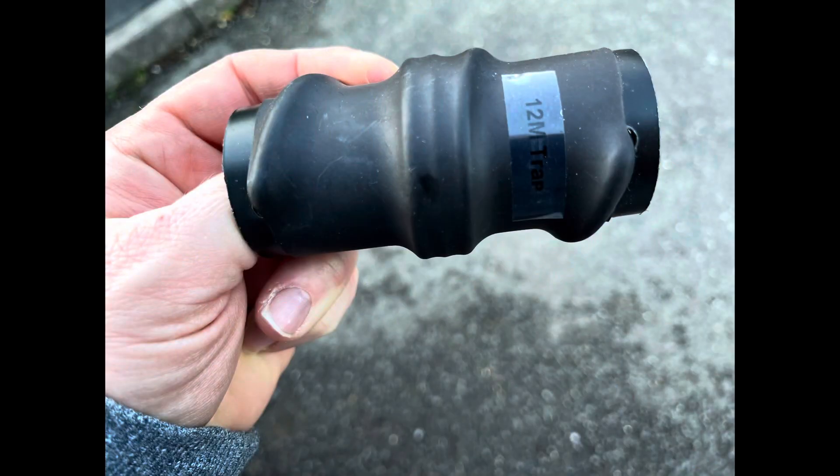And yes, we're going to use a coax trap. Now don't be afraid about using coax traps. Providing they're tuned just out of band, either below or above the band, then the loss is pretty minimal. And what this allows us to do with this antenna is to use a no-radial design vertical for both of these bands.